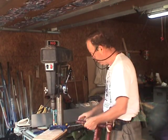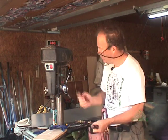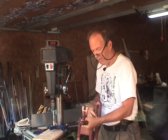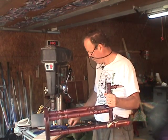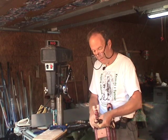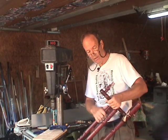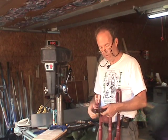And we're going to take our maiden post and see if it goes down through there. Let me turn it off so you can hear me. Great, goes right down through, and exactly the way we want it. And we can put that washer on now. And make sure it's parallel with the back. It's in there snugly. This is almost easier than the other one we did. Not much extra work other than drilling that wood out of the hole here that was glued in there.